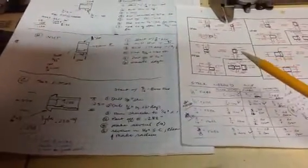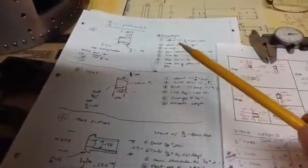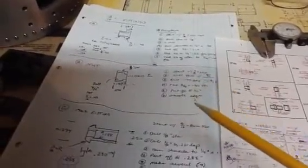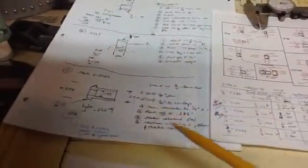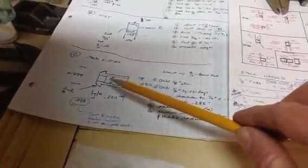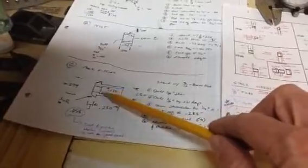And what I do is just kind of a best practice thing. As I study the original drawings, I'll make notes, and I like to blow them up, and I make myself a little order of operations, and I'll hang this up on the lathe as I go through, so I can go step by step. So here you can see the detail for the inside the male fitting. I drilled, and then I used a reamer to give a nice clean edge for the pipe to go into. This is the 1/8 inch through hole.